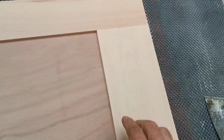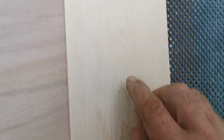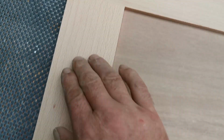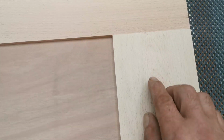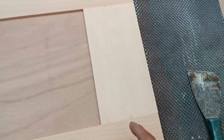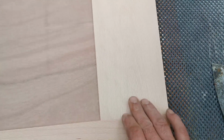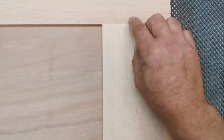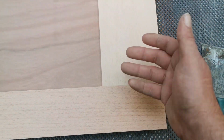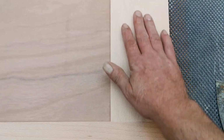So I just sanded that side. You see this little black mark here? You can just see it there. There isn't any more. But that's from the clamp when it was sat on the sash clamps. Doesn't matter, this is going to get sprayed, but if it weren't going to get sprayed, I'd put a piece of hardboard up underneath, make sure that the wood isn't touching the clamp.